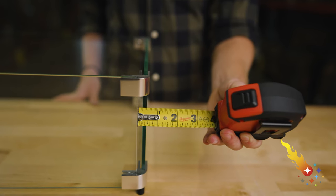Do this for both length and width of your flame guard. Now that you know the size of the glass panels to order, you want to decide the thickness of the glass. I recommend using tempered glass that's 3/16 of an inch thick. However, if you want, you can go up to a quarter inch thickness. Contact your local glass store and order the four glass panels — let them know the size and thickness you want. Tell them it should be standard tempered glass with polished edges. You don't need high temperature ceramic glass, which is very expensive. Standard tempered glass is good up to 470 degrees, which is more than sufficient for an outdoor fire pit.